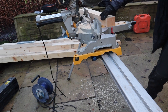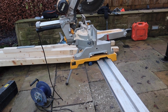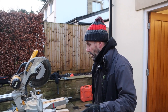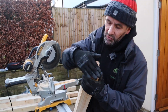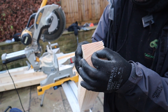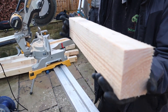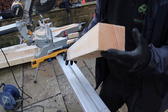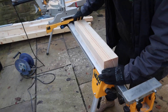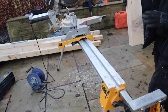That's the four extra timbers there — that'll give us enough to do our cross members, and then we've got the side members which are long enough anyway because it's three and a half deep and they're 4.8 long. Like I say, it's been pressure treated. It's been in a vacuum tank and what that does is draw all the treatment right to the centre of the timber, so that's fully treated 4x3. I know some of you are struggling to get this — it's actually a wall plate, so that will go on top of your inside skin of your house wall and then your roof will be cut into that with a bird's mouth.